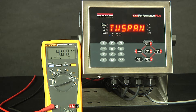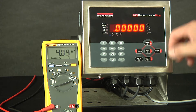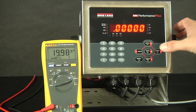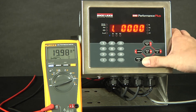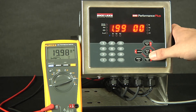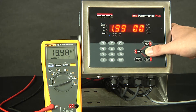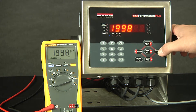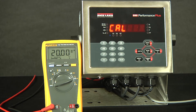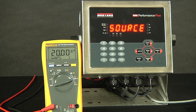We are now at tweak span. If we drop down, we can see 19.98. This is the same as before — we type in the number. Once we have 1998 entered, we hit enter the first time and now we select our decimal point location. We move it to 19.98 and hit enter. It calibrates and the milliamp changed to 20.